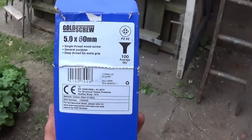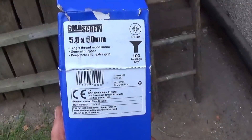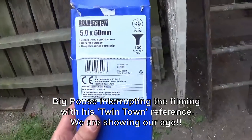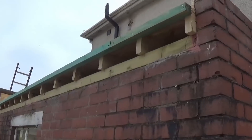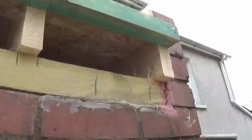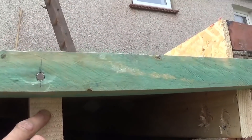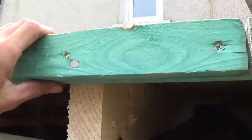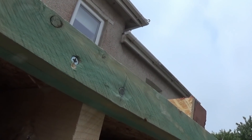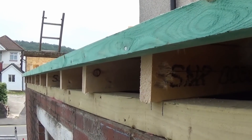These are the screws we've been using to screw the OSB board down into the joists. You need to use a screw suitable to go through the depth of your wood and into your joists - these are excellent wood screws, you get these from Screwfix at a very reasonable price. We've applied the batten along the front of the joists - all we've done is drilled a hole through these battens and nailed straight into the joists. This gives a big enough overhang so that when we put our rubber over it, it'll drip down into the gutter and not fall short. We've done that all the way along before applying the fascia board.